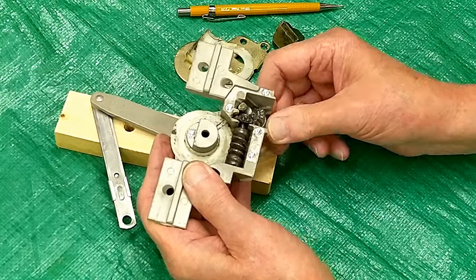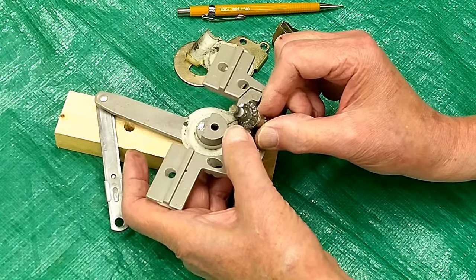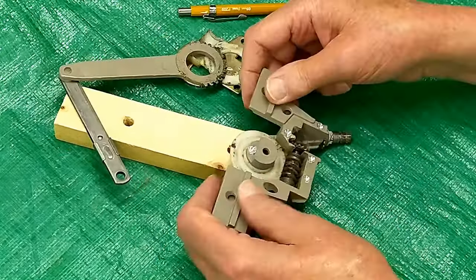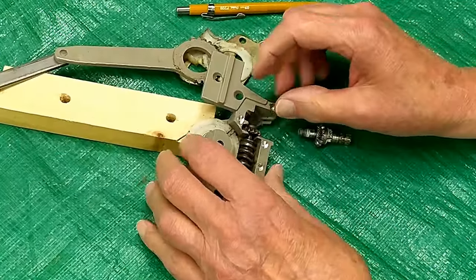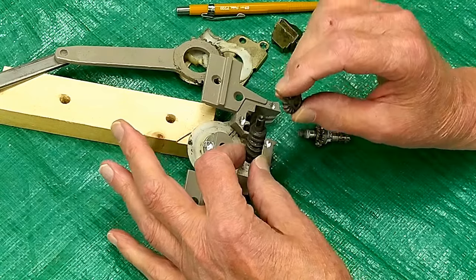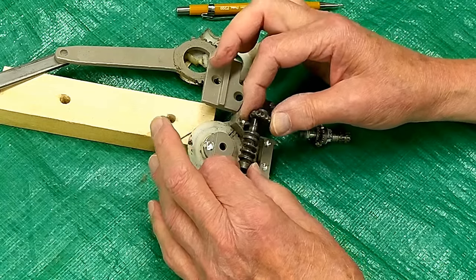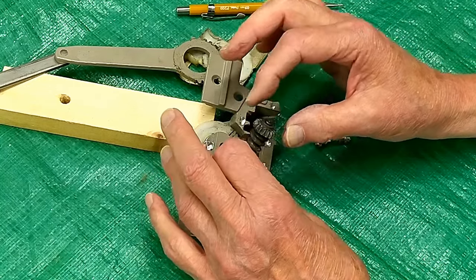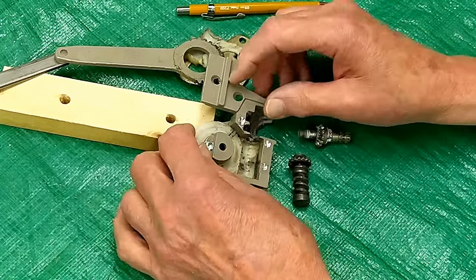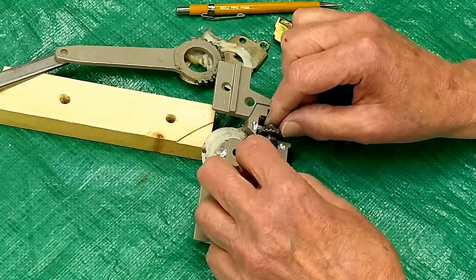This works freely when it's new. We can see that this is a little concave on these teeth — that's skipping on there. This is two pieces: you have the worm gear, and this one is keyed to that shaft — not keyed exactly, but it has a flat on the shaft that it engages with.